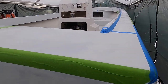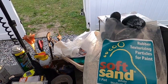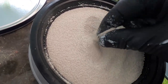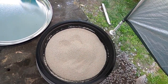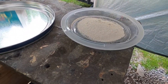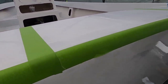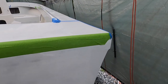Today I'm doing the non-skid — waiting for the paint to catalyze. It's just rubber texture particle soft sand stuff — really hard to get and really expensive. Very soft to the hands and I'm very curious what it'll be like once applied. I made a custom broadcaster from an old take-out tray by drilling a bunch of holes in it, and I just plan on shaking it over the paint when I apply it. I've taped off sections. Mixed 8 ounces total of paint. Not sure how much GoPro battery I have left, so I might just roll it out section by section.